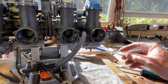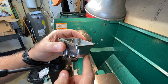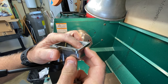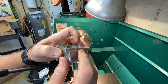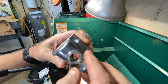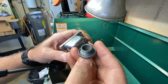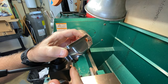The service fuel level, if you're unfamiliar with it, is tapping off the bottom of the float with fuel applied to the carb and running a clear plastic hose around the side, so you get a real-time accurate measurement of where the fuel is — because the laws of fluid dynamics are going to make sure those two are equal. So if the fluid level is a couple millimeters down below the top, it's going to be a couple millimeters down below the top on the outside as well.